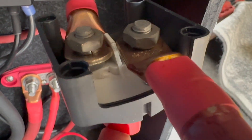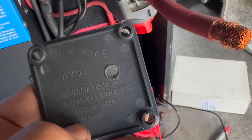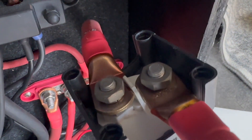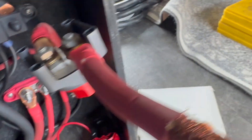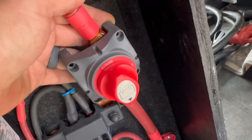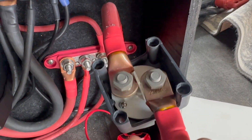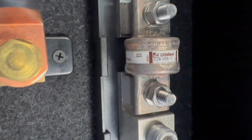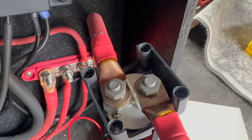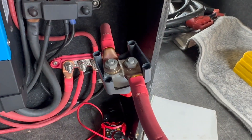Take a look in here — you can see definite evidence of melting. On the back plate there's a witness mark from something that got real hot and pushed into there. These switches are rated at best maybe 150 to 200 amps continuous, but if your fuse is at 400 amps and this is only rated at 200, guess which one becomes the fuse? That one — because it's going to fail first, and it did.